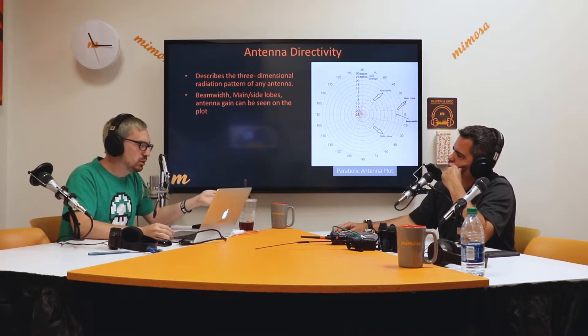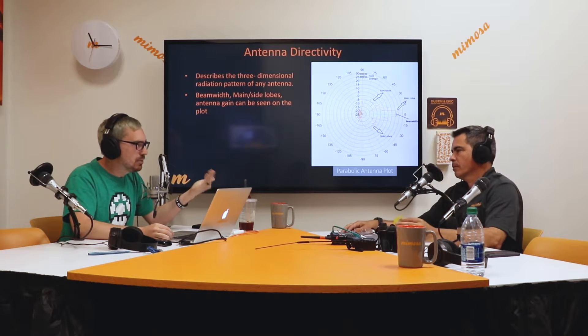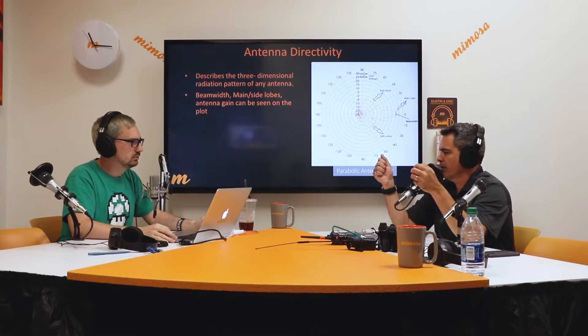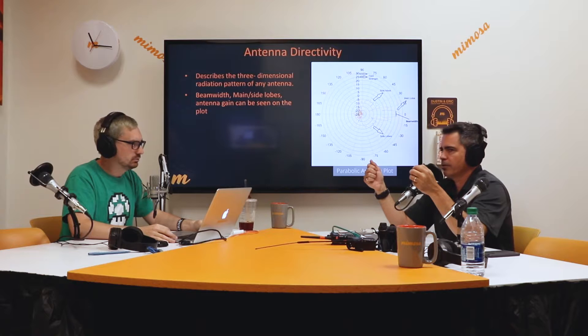If you don't spend enough time doing it, when you're aligning left and right or even up and down — horizontally or vertically — you might end up on a side lobe if you get connected. You're just like okay, I'm done, but then you wonder why your signal strength isn't as high as it should be. So when I'm going horizontal, I find a peak and make a note of it. The other guy is looking at his RSSI. Make a mental note of the best you got on that horizontal.